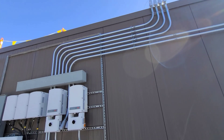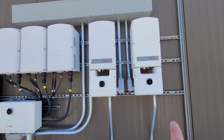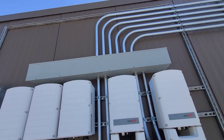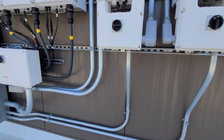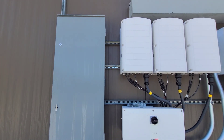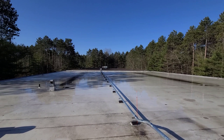These are the inch-and-a-quarter home runs. We're using 1000-volt rated PV wire in these as well, and then you have the SolarEdge inverters — a 20, a 30, and a 100 — gets us to 150. The wireway up here splits all the strings down into the inverters, and then the outputs of the inverters go into the AC combiner, which is this massive load center. This thing is taller than me. Three-inch conduit all the way across the roof.